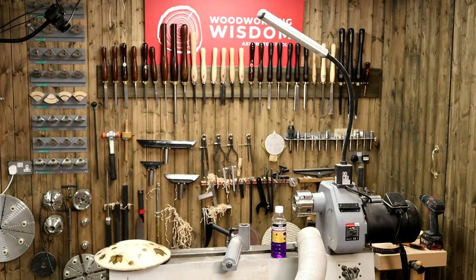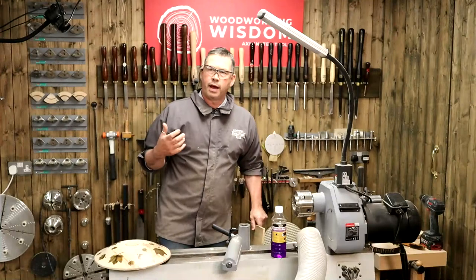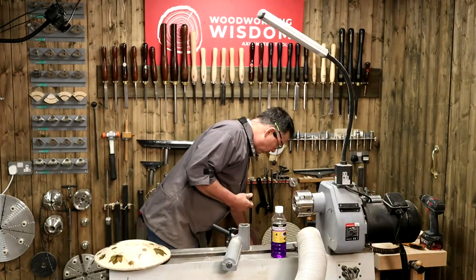So say you're picking out ripple and things like that, just sand to, I would say, probably about a 240, put your layer on, then sand back. Keep going like that, otherwise you're not going to get that penetration.